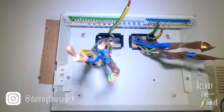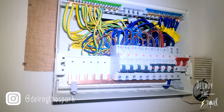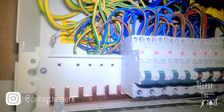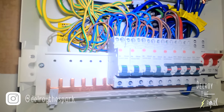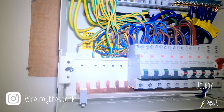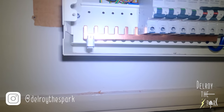When you do these fuse boards there's always something wrong. If I'd got a Crabtree the switch would have been on the other side and those would have been short, so it's all good. The board is not fully completed yet — see that and that? That's the main earth and I think this is also a main earth. I need to go and get some 10 mil and 6 mil to join them properly with crimps.